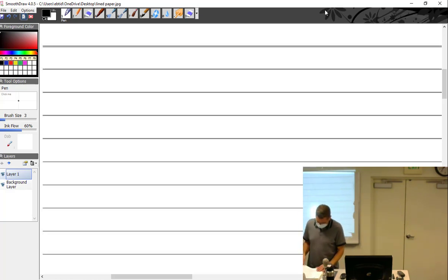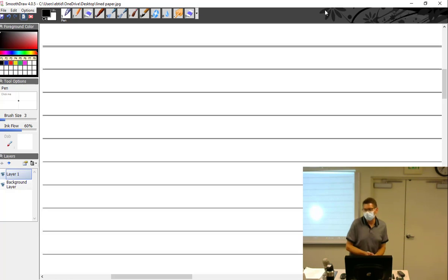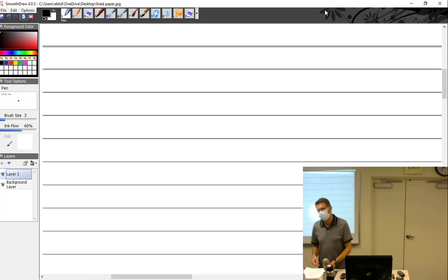All right, operating theory: the chemical process that occurs beyond the scope. Oh, we did that one. 6, sulfate ions, hydrogen, electrons, plate, lead sulfate. Battery charges, discharges, electrolyte becomes more? Water-like. And then the state of charge of the battery can be checked by using a? Hydrometer. So if it's more like water, it is? Dead. And if it's more acidy, it's? Charged. I think acidic is the proper word, not acidy.